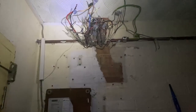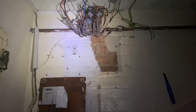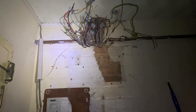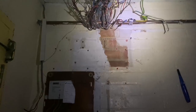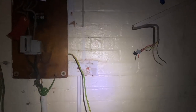This is getting more complicated than expected. The cables aren't that long — long enough to go to a board just below that gas pipe, but there's not really room for trunking on top and compression glands, so I'd end up doing a bodge job. What I've decided to do is bring it down lower, put an IP box up there with connectors, extend all the cables down to there, run a neat trunking down, and do it all properly.